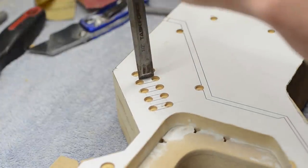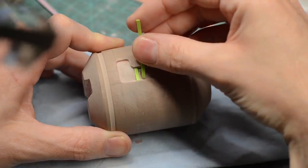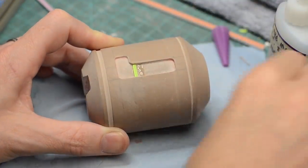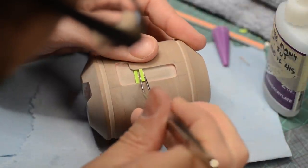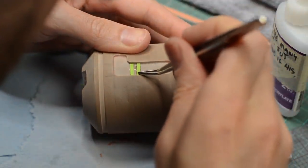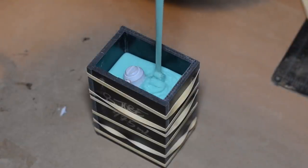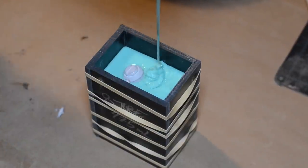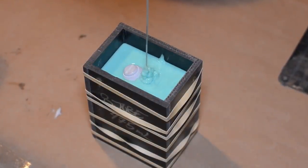And then there are also round pieces — how did you make those? A lot of the tubes and cylinder-type things I made on my lathe. I used a high-density polyurethane tooling foam that Frank says is called Renshape, put those in my lathe and turned the pieces out that way. Once I had those, that was basically the assembly of a prototype to then mold so you can make replicas. Especially those tubes — there are 24 tubes along the barrel. I didn't want to put my lathe through that, so we made a mold of those to make copies.